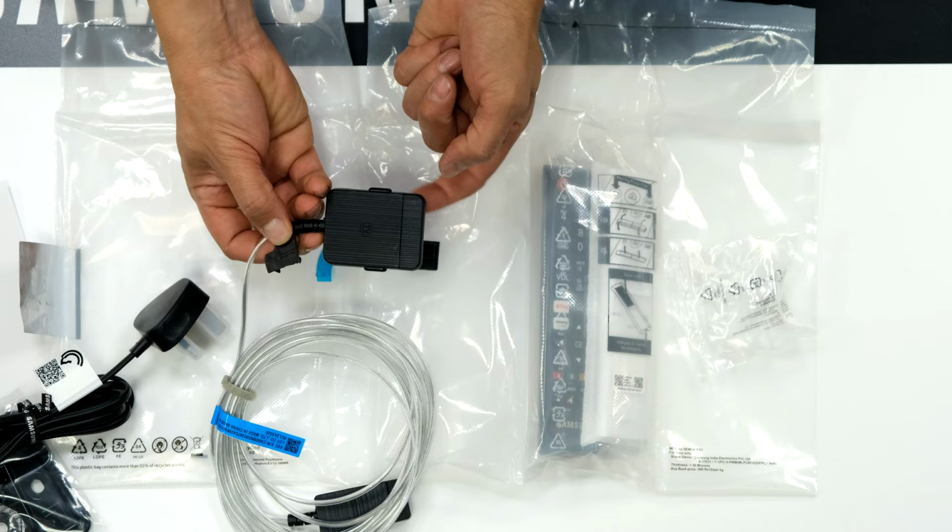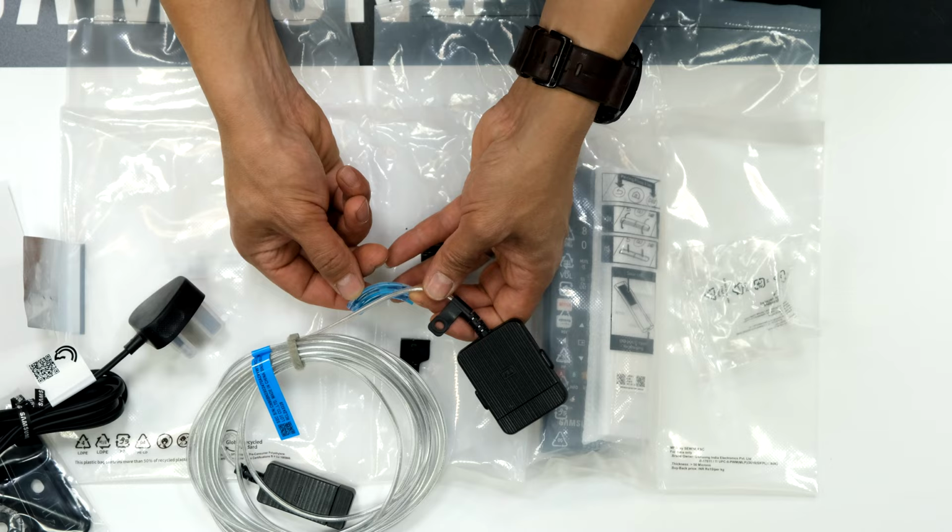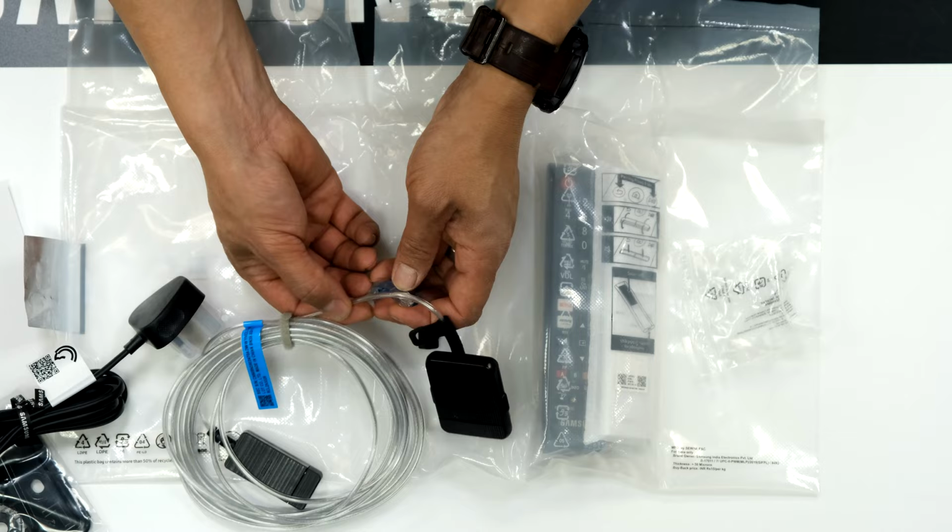and break the connector on here, because that's an expensive lead if you have to replace it. Also, if you are working with this, no sharp bends. That's why it gives you this radius piece here, which is also self-adhesive. If we need to make a corner bend, it gives you the correct radius for that cable, so you're not going to break it, and it goes in like so.